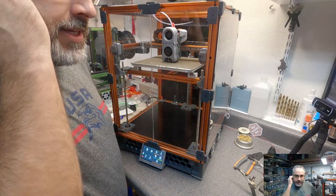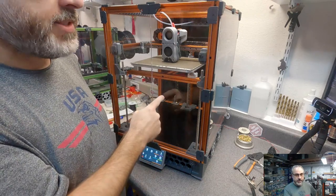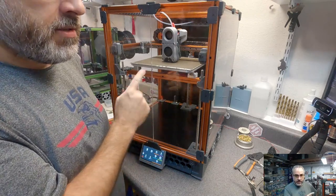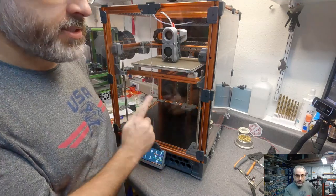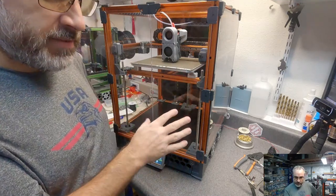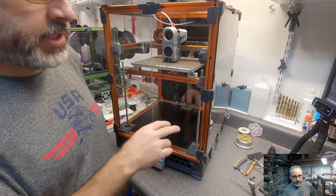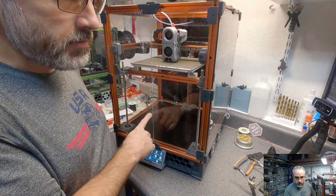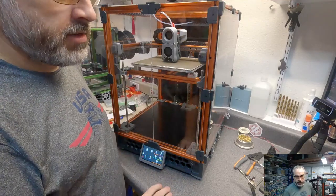Does anyone use a PT1000 on an Octopus normal thermistor port? That's what I'm doing right now. This one is set up as of yesterday, PT1000 plugged directly into the thermistor port. It's supposed to be already running the 4.7K resistor or whatever that you need for that, right? Everything I looked up said so. So this is there and ready.